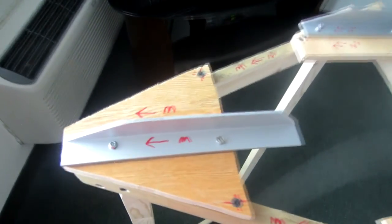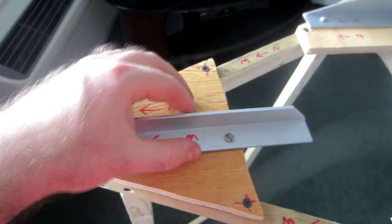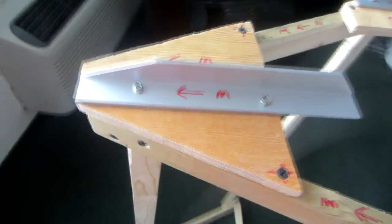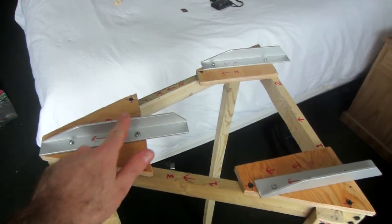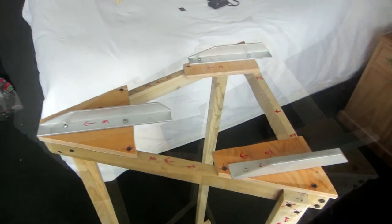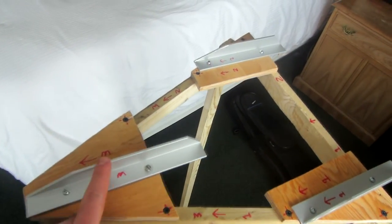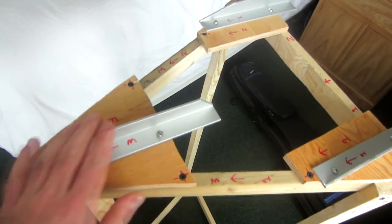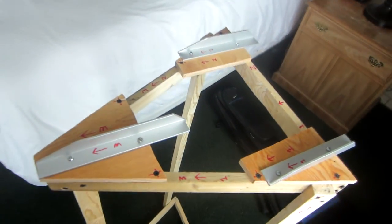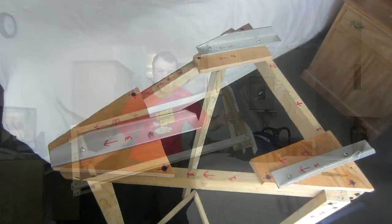The blades are made from angled aluminum. I bought a long piece of aluminum with this cross section and cut the ends on angles to turn them into blades. I made the front one a little bit longer than the two side ones at the back. Since it's just being used for pushing a camera along the ice there won't be very much downforce on the blades, so I don't expect them to wear very quickly at all, even though aluminum is a relatively soft material.